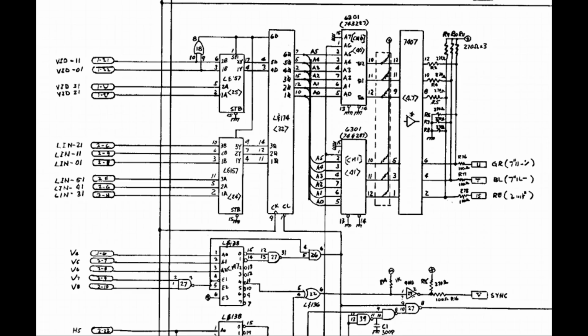So let's see how the video output circuit works on this game. Like on most other games, the 3 color signals are obtained by combining the outputs of some color PROMs with a simple resistor weighted DAC. In this case, there are 2 color PROMs, each contributing 1 bit to each color, plus an open collector buffer IC before the resistors. Of course, the 2 PROMs were dumped initially together with all the EEPROMs, so I'm sure they are both good. It must be then something bad in other places.